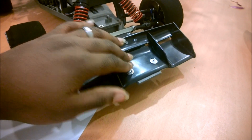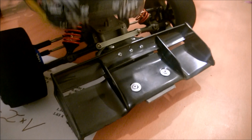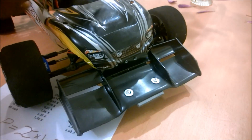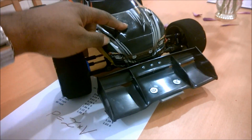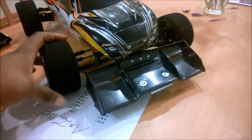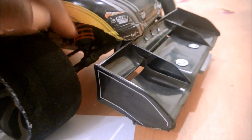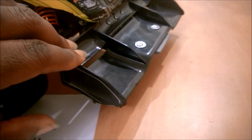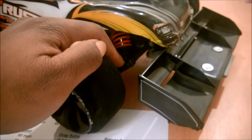I think that the center section is not too bad, especially when you take into account that when you put the body of the car in place, it actually does a fairly good job of matching up to the contour of the vehicle. And like I said, the primary reason why I like keeping this here is that if you look at the side of these suspension arms, they want to push air down. Basically, they want to make lift. They want to fly. I don't want that touching free stream air. So this is basically acting like an aerodynamic shield to keep this thing from making lift.